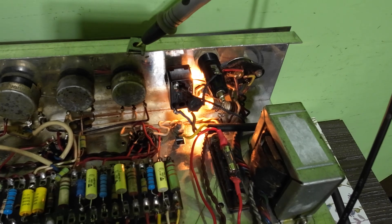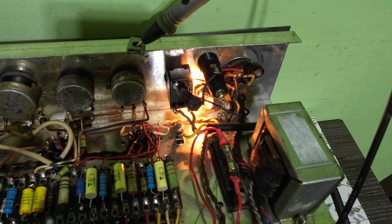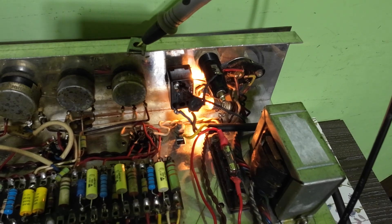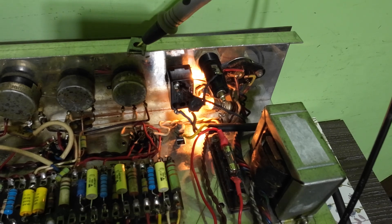Some comments left were valid points — one suggested doubling the caps to 1000-volt rating, which would be end of problem. But of course this is a vintage amp — where are you going to mount them? You can't start drilling holes in this chassis. On the other side, the tubes are there, the bias pots are there. Even if you could mount some, it would be difficult to find space. I'd be drilling holes into the chassis, which we can't do on a vintage amp. Had we been able to do that, it would have been the most logical thing, but unfortunately on this amp we can't.